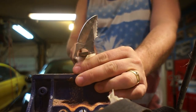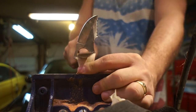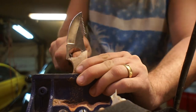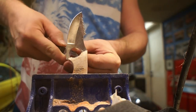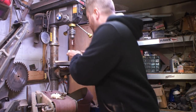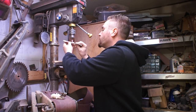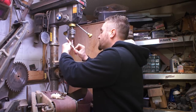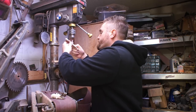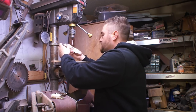The other place I had to file was part of the finger hole here. I had to get a little bit of extra clearance in there so I can get in there with the next tool. After I had it pretty close with the file, I went in there with the cartridge roll — just a little sanding roll. I also wanted to profile it out into the handle and give it a little bit of a compound curve inside there, so you can see I'm going at it diagonally.